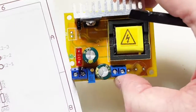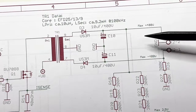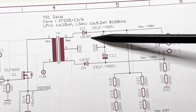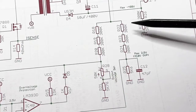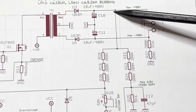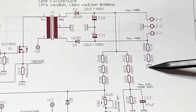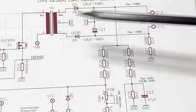Then you have this transformer. Here you see the design for two output rails, plus and minus — the ultra-fast silicon diode, 600 volts, 70 nanoseconds, about 3 amps. The inner loop is the voltage control loop and the overcurrent resistor string. The whole regulation of overcurrent is based on the positive rail output. If you have a negative output rail, you'll have two resistors in series that give a little load to the other winding so it's not completely open.